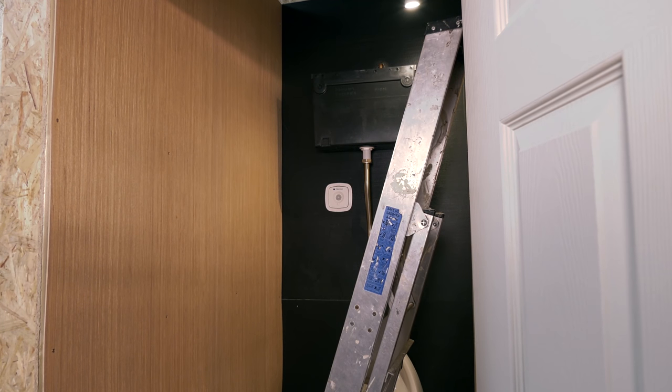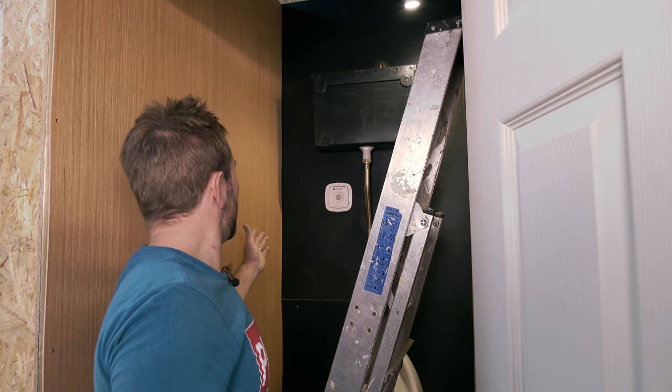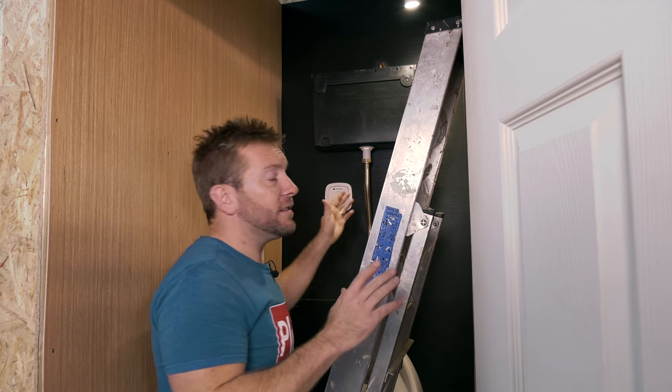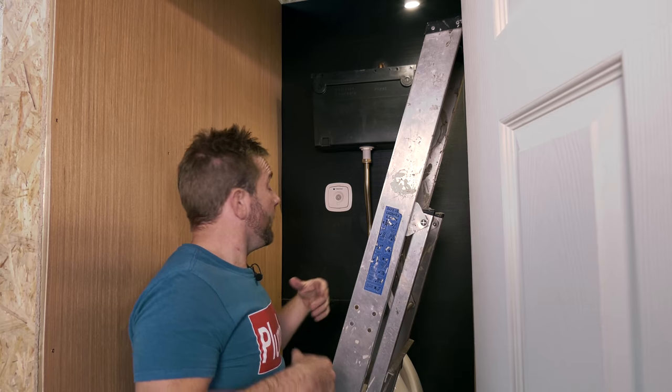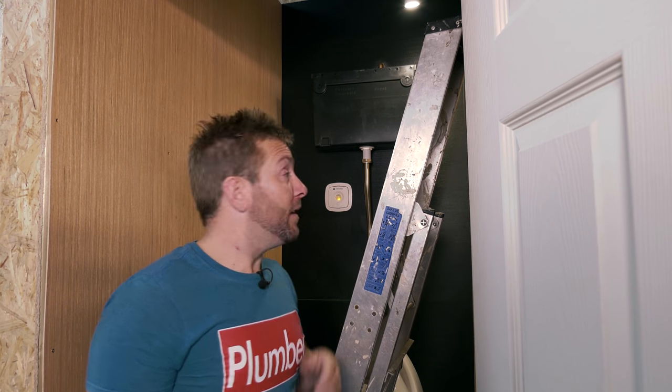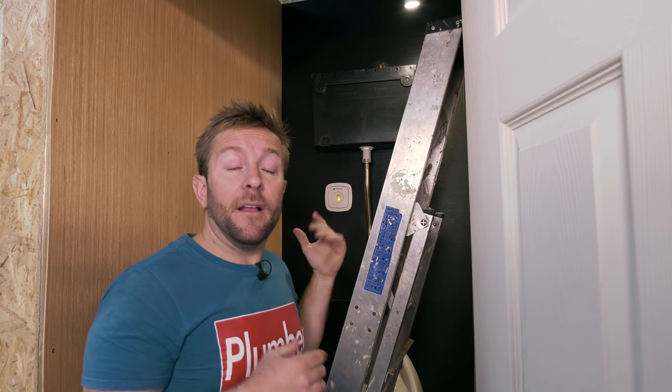After that guys, just want to make sure that it can see us. So there we go, now we know that it can sense us coming in and out of the urinal as well, and it will start to let water through. After about a minute of doing this test, it's commissioned and it's set up. Then what we can do is deliberately trigger the fill valve, and then we move on to the very last bit of commissioning, and that is what fill rate we want to attain.